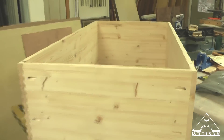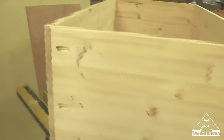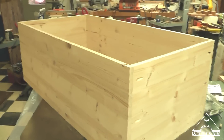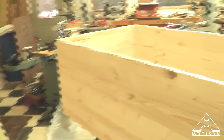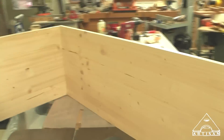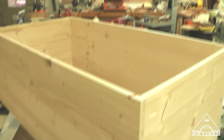Some woodworkers won't come into modern times and use quick and effective fastening methods. I've spent more time videoing this thing than I have building it. It's a nice way to make a quick carcass for an inset bookshelf. After it's painted, we're going to come in and put the adjustable shelf brackets in there. If we wanted to spend a lot of time on custom work, we would drill holes in the side for little pins to hold the shelves. You've got to match your methods to the project.